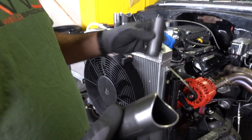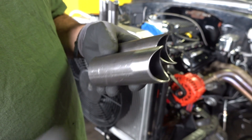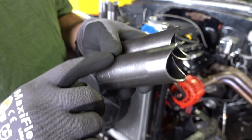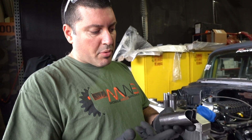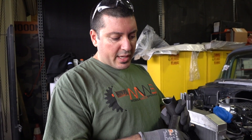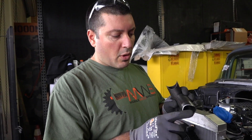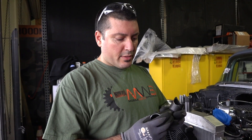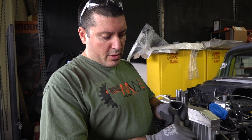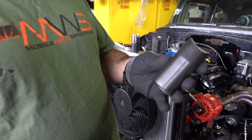You can see the end of the tube here is cleaned off. That grayish-brown color, however the tube's manufactured - that's mill scale. It's just a byproduct of the manufacturing process. You want to get that off the best you can without sanding a bunch of material off the tube, because then it won't be the true wall thickness anymore. Some Scotch-Brite or a piece of sandpaper - you just kind of work it back and forth and clean it up. And the same goes for where you're landing your tube.